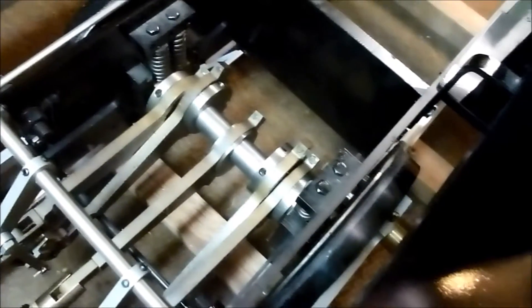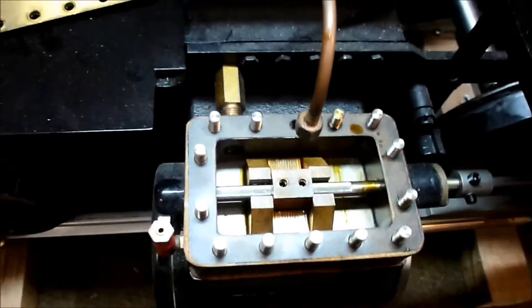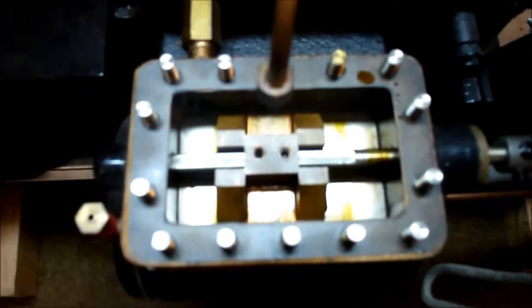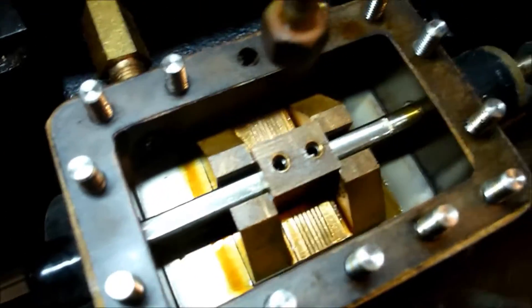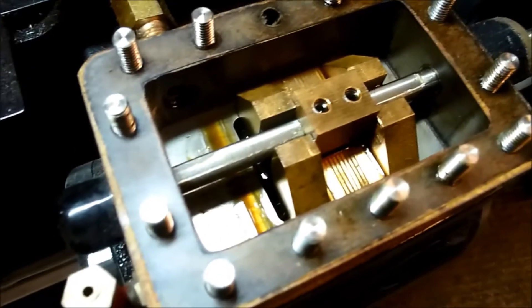So far we've only looked at the two eccentrics. Once we're happy we've got those in the right place, we can move on. We've got the cylinder with the valve on top. The aim is to set that valve so it will move correctly to distribute steam down into the cylinder. We start by centralizing the valve — putting the reversing lever in its mid-gear position — so there should be minimal movement of the valve. Looking into the top of the steam chest, there's just a small amount of port opening at the back, and we should get the same amount of port opening at the front in half a turn of the wheels. That's with the reversing lever in mid-gear. Next we move it down into full gear.